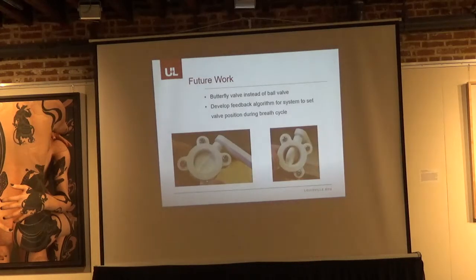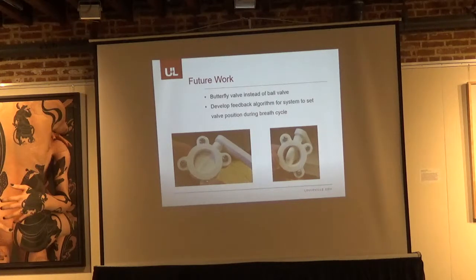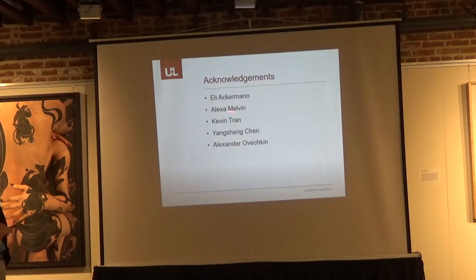We have moved on from the ball valve and designed our own 3D printed butterfly valve, using a spray gasket material, and are starting to integrate that into our system to avoid the high resistance of the ball valve. Future work includes developing a feedback algorithm so the system software can automatically change the valve position based on maximum exhalation/inhalation pressure to maintain training resistance — no matter how hard you blow, you will never exceed that training resistance value. We actually have a few companies interested in licensing the technology, which is a recent and exciting development.